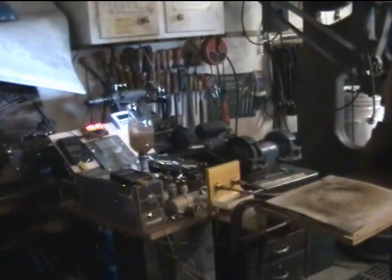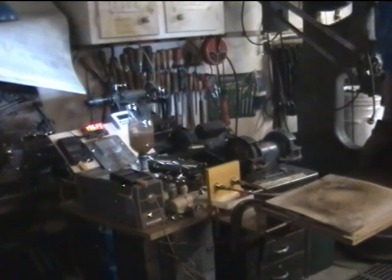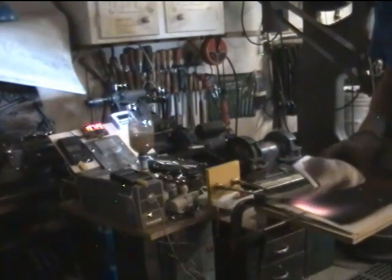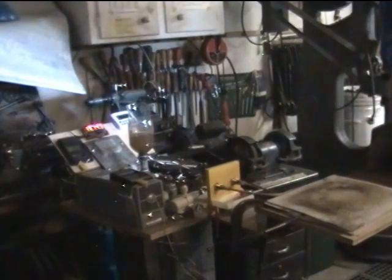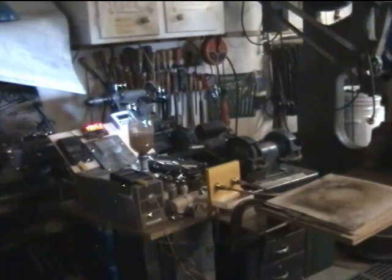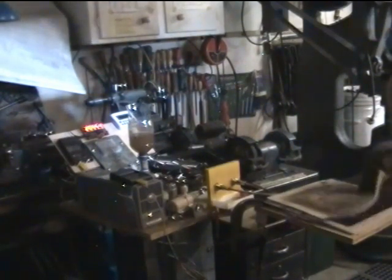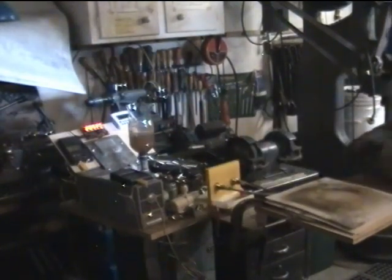Sorry about the smoke. Went back to 24 amps, and the power supply goes down when it goes below 25 amps. So now we are almost 3 minutes into the test. I don't want to lose my thermocouple, but I do want to peek — and there we got some orange. Right on the 24 to 25 amp range, 3 minutes in. I don't have it laying flat, I've been tilting it up a little bit. Now we're back up to 32 amps, 20.7 kHz, 3.5 minutes into the test. Glowing pretty good on some edges there — 630 Celsius.